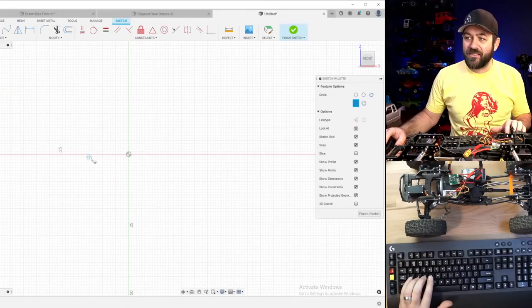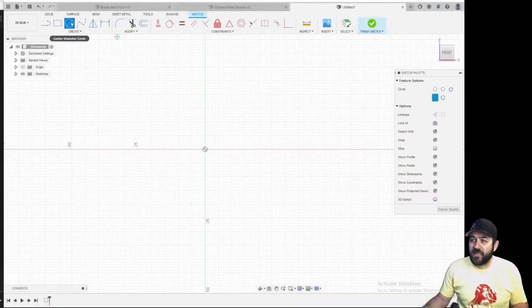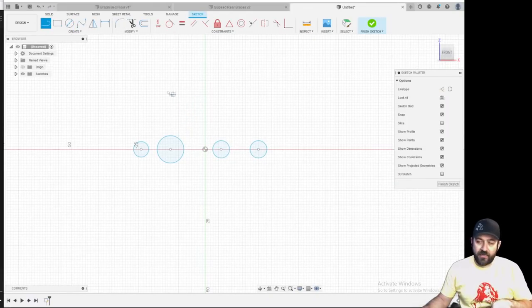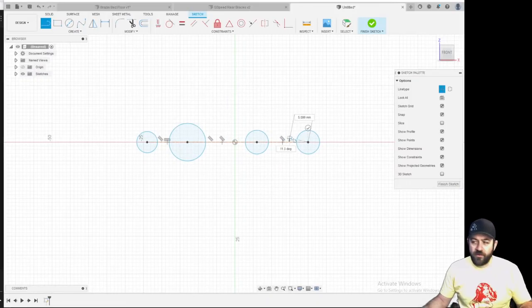That's okay. Let's just start with a couple of things. We're going to select circles, which is just off the screen up there. I selected a circle, and we're basically going to start by drawing a few circles. They don't have to be equal size or anything like that. I drew 4 on there because I think that's what I'm going to use. I'm going to press L to select line, or you can click up there, and then I'm going to hit X, which toggles this little button for construction. They're just guidelines. So I'm going to go from center to center of each one of those.